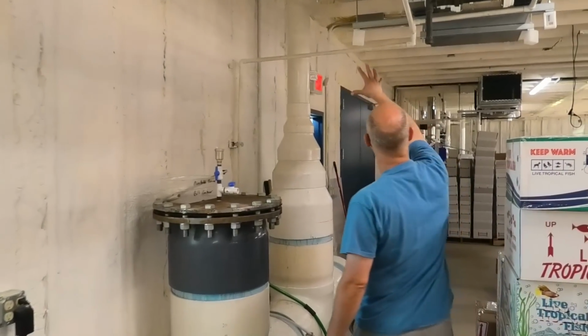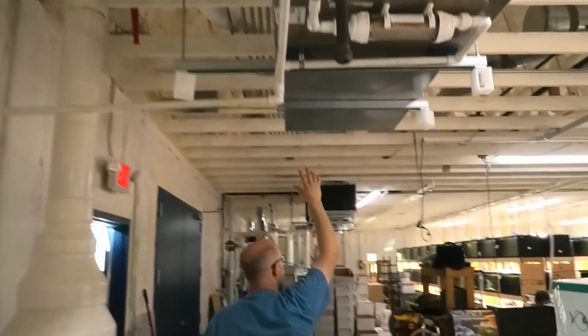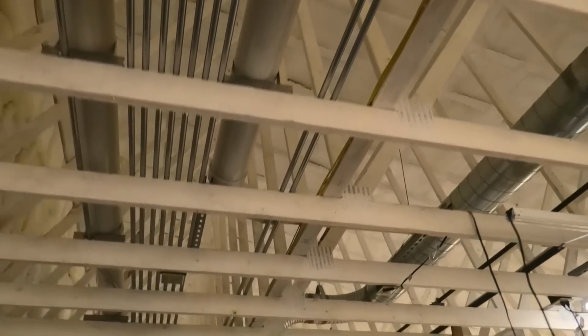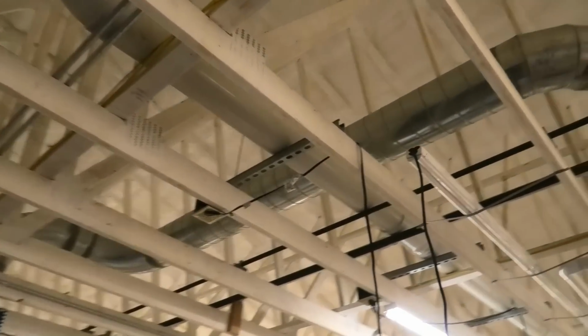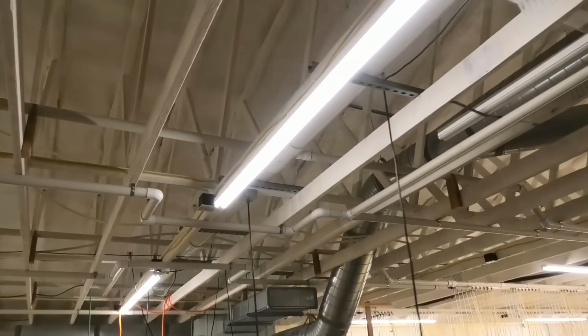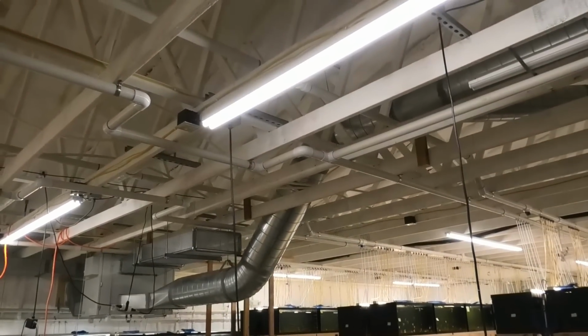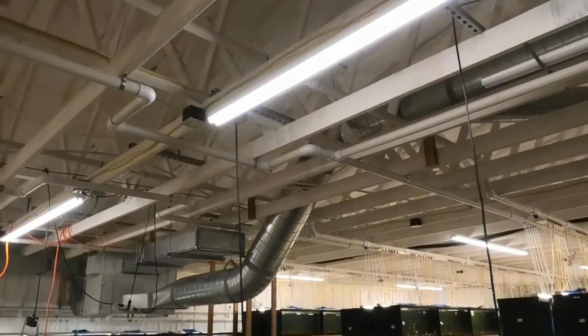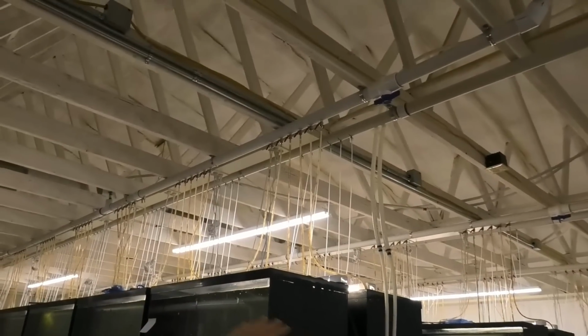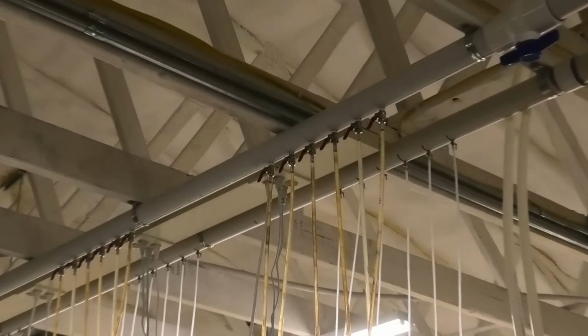After this, it leaves, and now it comes through this pipe. It's another big 6-inch pipe, and then we have several 2-inch feeds off that 6-inch that go to each row of aquariums. So all these valves, they're 1/4-inch valves that have the red handles on them. Across each row, that's where the water's coming down into the aquariums. So it's going to come down.